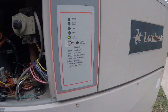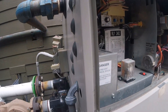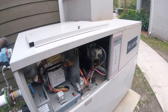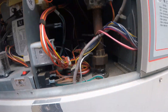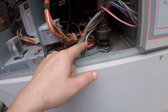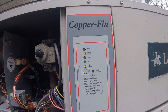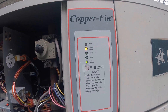It just fired. Pre-purged — it's gonna purge out everything. Having this cabinet open doesn't really affect it, because it's sealed from down here and it's pulling out of this pipe here. Trial for ignition — fires, and it goes out.